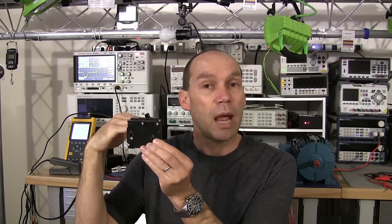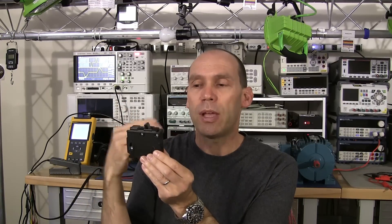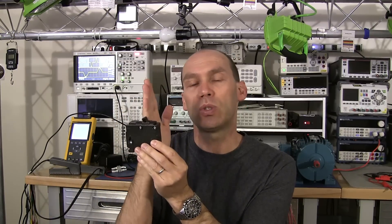In this video we're going to cover doing measurements on an oscilloscope. We'll talk about where inrush current measurement is perhaps most useful: understanding circuit breakers, where they can run at a certain constant current and then have an instantaneous breaking using either thermal or electromagnetic switching to protect against short circuits or peak inrush. These can be affected when a motor starts up — there can be a surge of current which will trip the breaker.